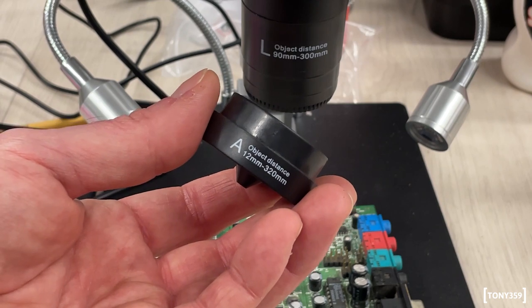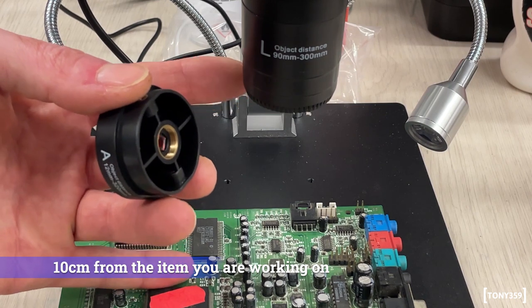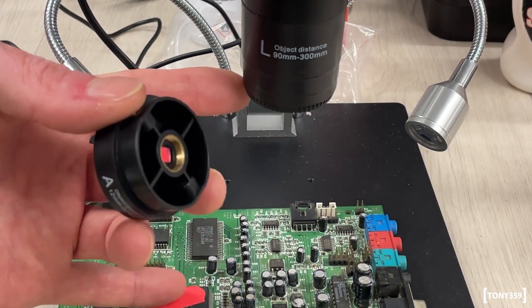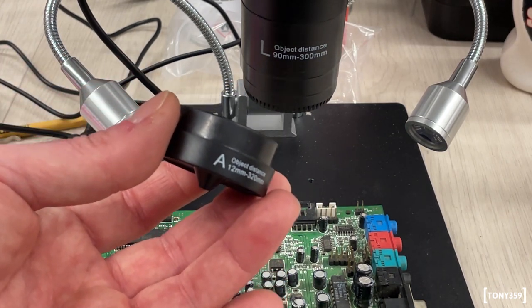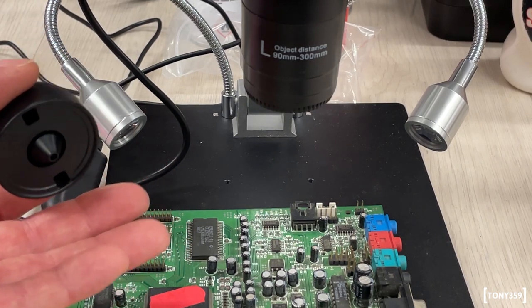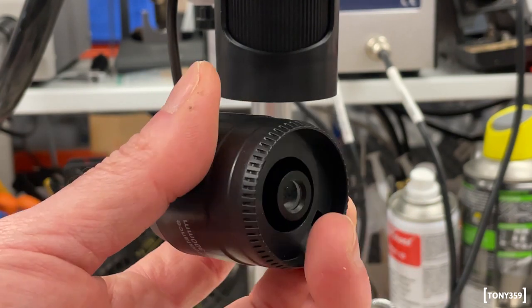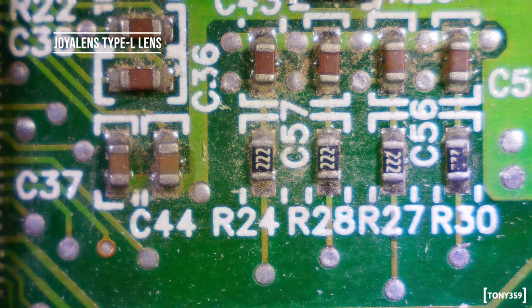You might think: why not just use the A lens and accept 10cm as the working distance for soldering? Unfortunately I've measured that at 10cm from the board, the A-type lens only gives you a 31mm working area, which I don't think is enough. The L-type lens is probably the most suitable overall. Looking at this lens, the optics are actually pretty small — that's why there's no option for a Barlow lens, there's no thread at the bottom, and the whole casing is in plastic.